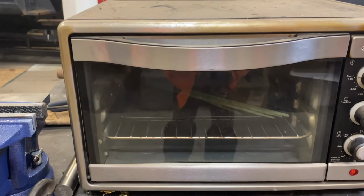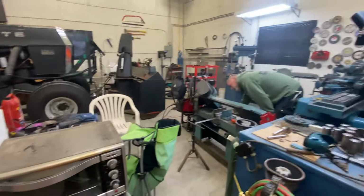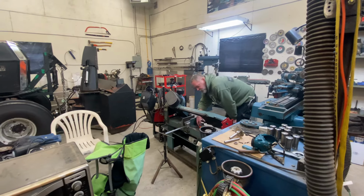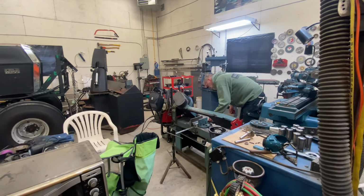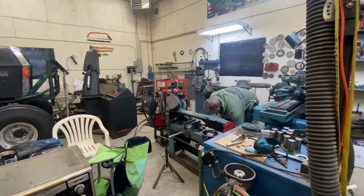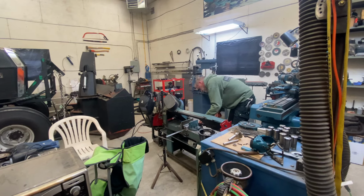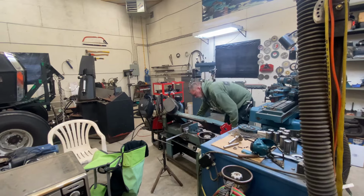Well, those rods have been kicking around here for a couple years. So I'm just gonna cook some of the moisture out of them while I'm doing these other jobs. I should get better results when I go to tack that stainless nut onto the stainless bolt that I'm using for a shear pin, so it can't rattle out like the last one did.